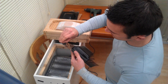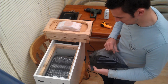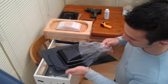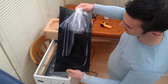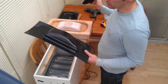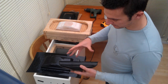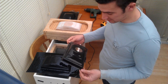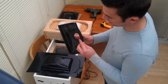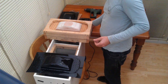There's the mould and there's our finished shape. What you can then do is peel off the protective film. And now it pops off — a beautifully high-gloss plastic product made in your own garden shed — this is my conservatory actually. As you can see there's a slight mottled finish to the top of this one and that's because I've overheated it slightly. What you then do is cut it out. Here's one I made earlier — this is actually a cowling for a small heat exchanger for a liquid-cooled PC system. The radiator sits in there and then a little fan screws to the back, which I've cut out with a hole saw, and it just draws air through the radiator — the heat exchanger, whatever you want to call it.